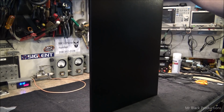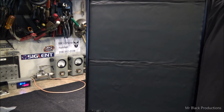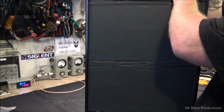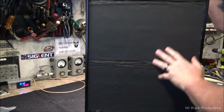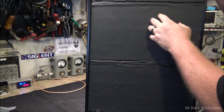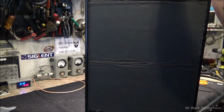So what I've done with my own boxes is I lined them with this stuff called Extreme Dynamat. Dynamat with a foam behind it. It's more heat resistant, adds more density, and it traps a lot of the higher end sound waves. Shorter, high end frequency sound waves, like rotary blade noise.